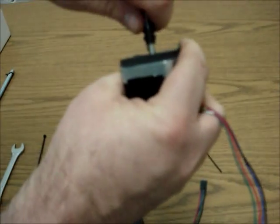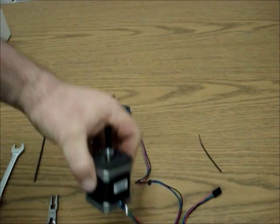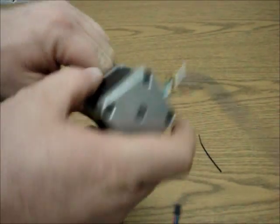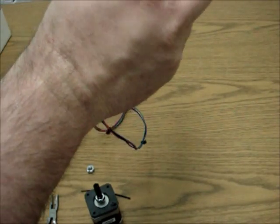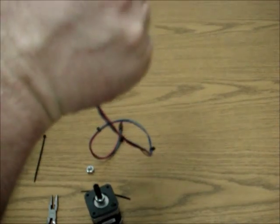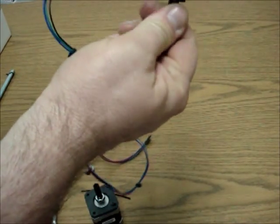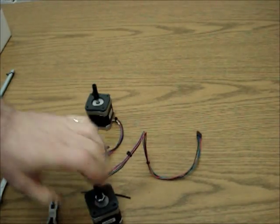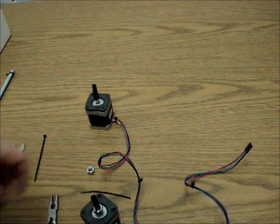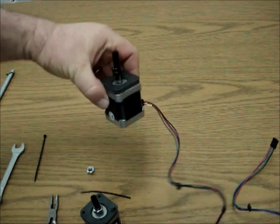This one here, the holding force is pretty good too. Use the easy way if you want to - if you want higher holding force, you can do it the hard way. Truth is, either of them will have more than enough force to hold it, because you've got to realize that the whole X carriage is actually held by this. If you put the little wire tie up and cinch up the little D-slot that's in there, this method works really, really good. If you want super high force, the second method is harder but works pretty good too. It's your choice - either way, you need both of them done. Do them both the same way.